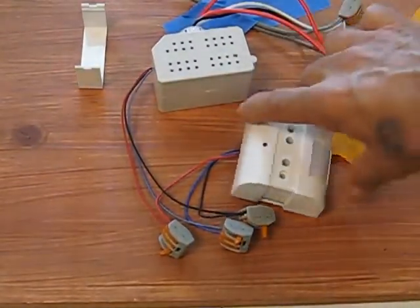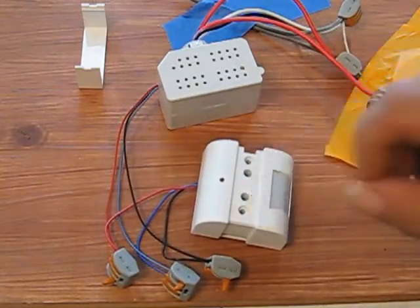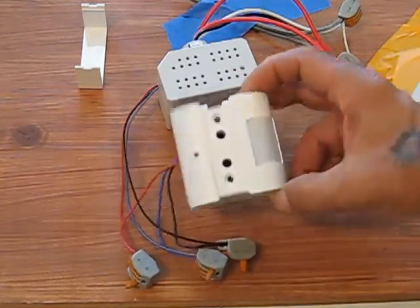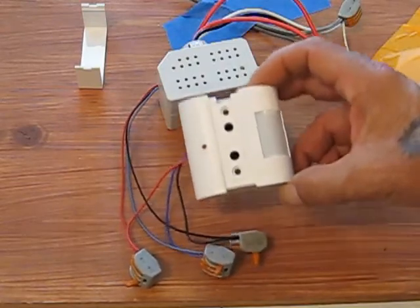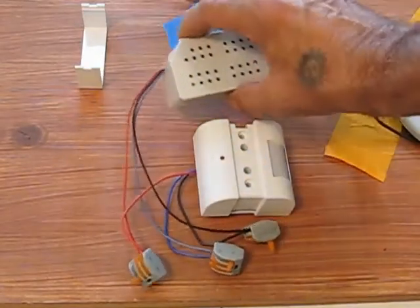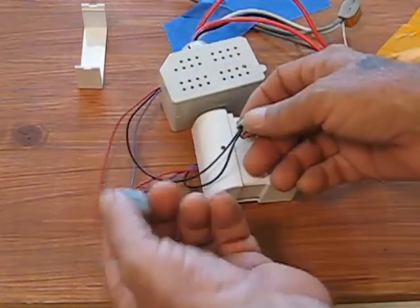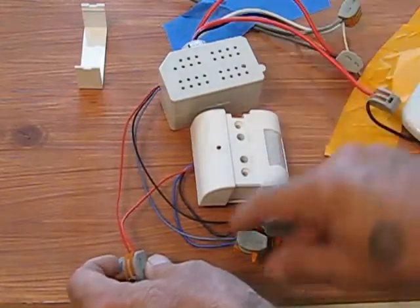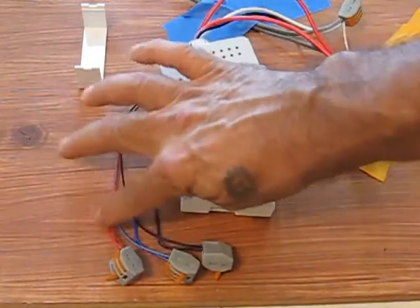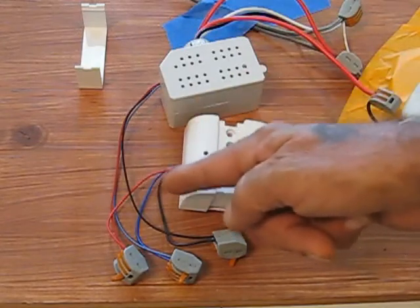We are ready to have a look-see at our little sensor. I'm going to turn the time adjust all the way down, which will make this thing work really fast. It has no daylight sensing in it, despite the fact that this is a plain flat auto-on control. We have our +24V attached coming from the power pack, our -24V coming from the power pack, and our control line. This is going to activate the power pack by connecting the positive to the blue. None of these wires are connected to ground, none to neutral, and most certainly none to line voltage.